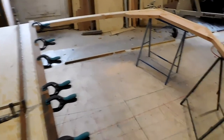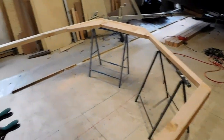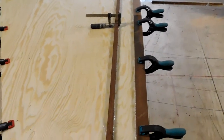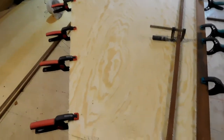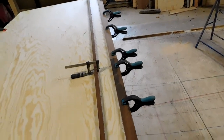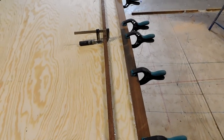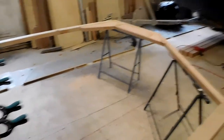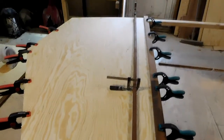And yeah, all sanded up. I sanded up that deck beam, I've sanded up that brace down that side, things that needed doing. Put a bit of epoxy filler in roundabout. Cleanly cut that mahogany and put it in position. Again, recycled, obviously. Battens round the side underneath, so you can't see them, but you see the clamps there holding them in place. So that's the state of play. Tomorrow, I need to flip it over and sand that side. I'll obviously clean up the glue here on the mahogany first. But hopefully she'll get a bit of glass and epoxy on that bulkhead tomorrow. That'd be very good, and it's getting towards finish. No, it's complete in its form. It's just some finishing off needed now. Yeah, that's where we are today.